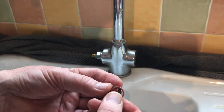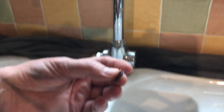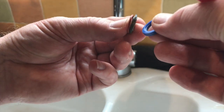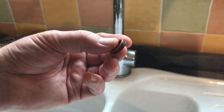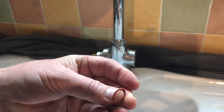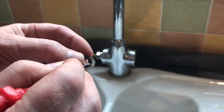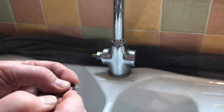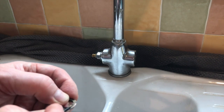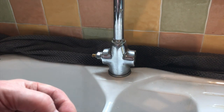The ceramic insert valve has the ceramics, then a thin washer, then a double brass collet, and then the large washer at the end. The end section with the washers comes out. It most likely just has a small amount of scale on it which you can rub off gently with your finger. Clean the brass insert on either side to make sure there's no limescale on it. The integrity of it seems pretty good so it could just be a bit clogged up.